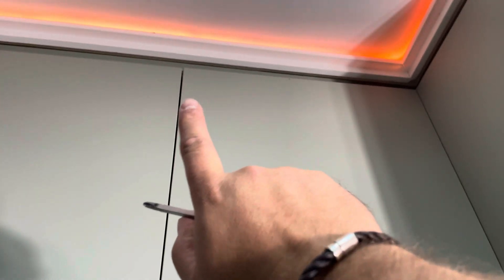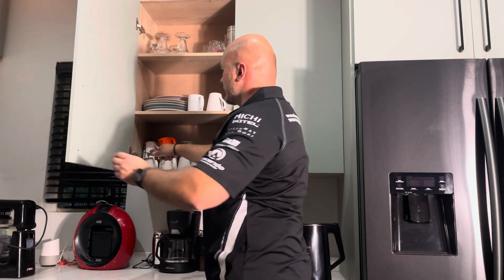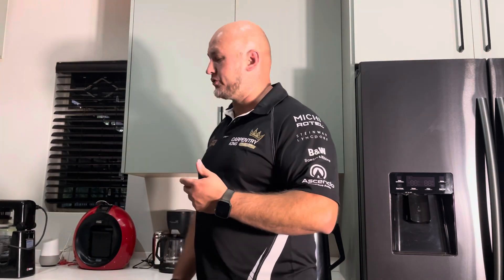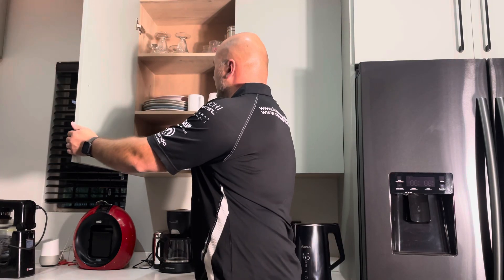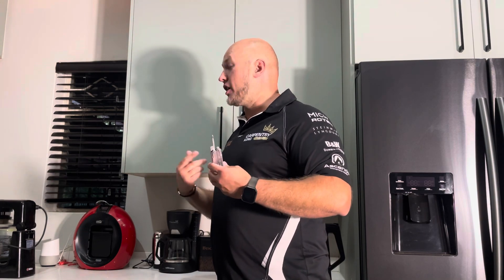I think what I will do — because now if you can look, this gap is becoming bigger when we go to the top. So this door we want to bring over slightly. Always check, because if you are doing that gap you want to keep it so that gap is going out. So it is a little bit of back and forth. If we bring that out too much, that gap on the side is going to get way too big. So the better solution here will be to go back to the original spot and we are going to have to lift this door slightly up. I am going to need more tools — I'll get them and I will show you what to do.